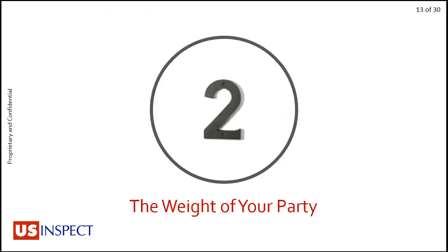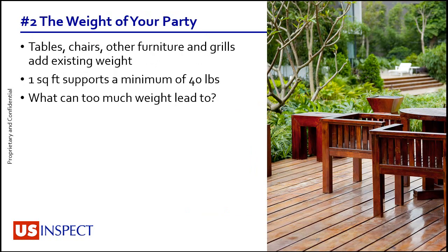Number two: the weight of your party. The deck has to hold all the people, the grill, and beverages — plus the weight of the deck materials itself. One square foot is usually rated for about 40 pounds. The issue ties back to number five — no lag screws or improper attachment of the ledger board. I mentioned grandma and the lit grill earlier because that actually happened to clients of mine. I inspected the house, found only nails attaching the deck, and said please fix this before any celebration. They ignored me — the deck detached, and grandma and the lit grill and everyone on it rolled toward the house. Thankfully it was only a couple of feet but it was enough to scare everybody.